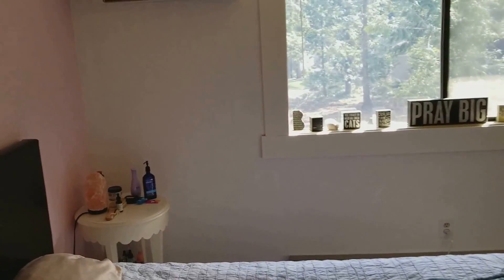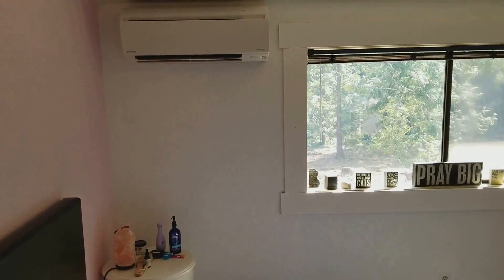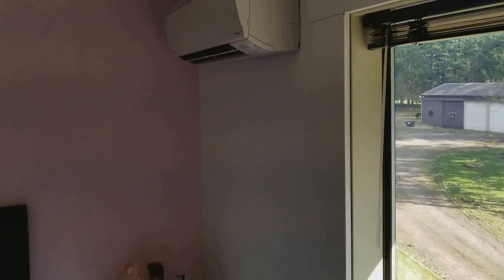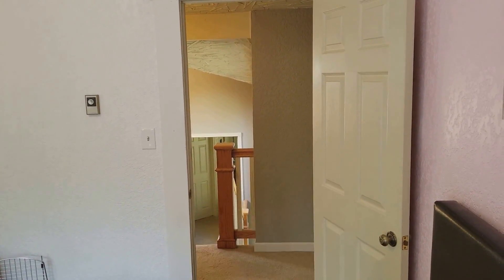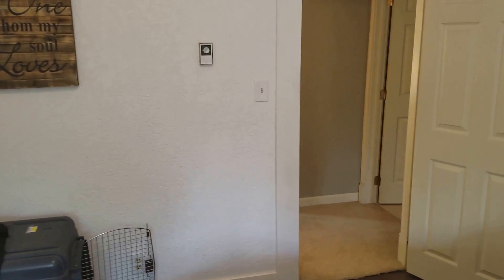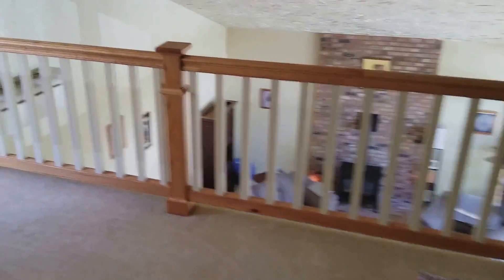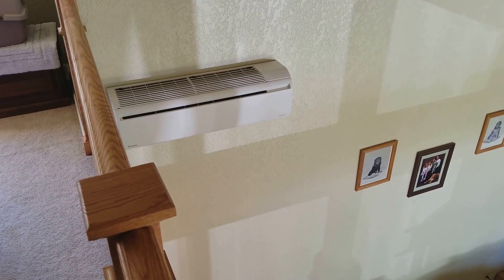We placed this one to blow right on the occupant of the bed — that was on purpose, but it was also a two-for-one. When we look at where this is, we know the upstairs is going to be hot and we don't have a lot up there. So we're lining up with the doorway, pushing some cooling out of this room because this head is too big for a small bedroom no matter what we do — we want to be able to push that out when necessary. So that's this place. If you have any questions, let me know. Daikin is a great brand — check out the Daikin Life if you haven't; that's the new VRV hybrid system. Thanks for watching.